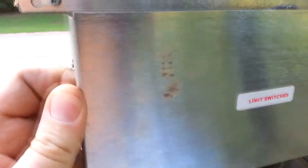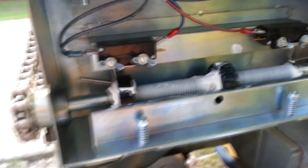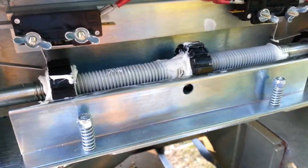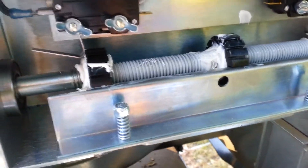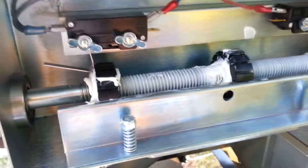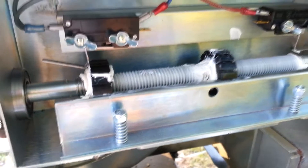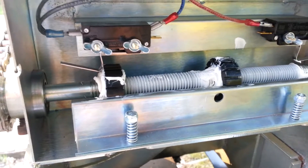As you can see in the beginning of this video, this particular gate operator still had the cover on there. So if the gate operator doesn't have a limit switch cover, that's also part of your routine service — make sure that it has one. Probably carry one with you for the popular gate operators: the All-O-Matics and the LiftMasters slash Elites. And Viking —